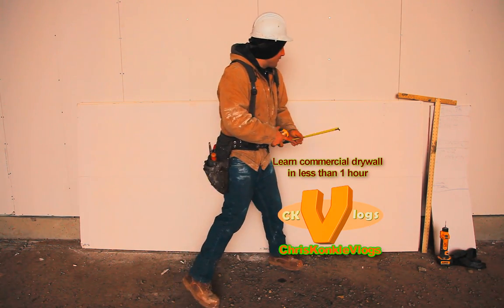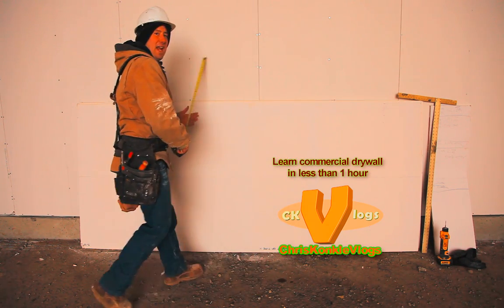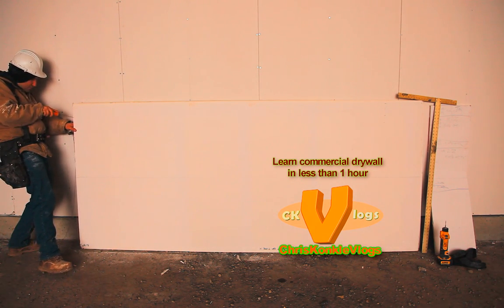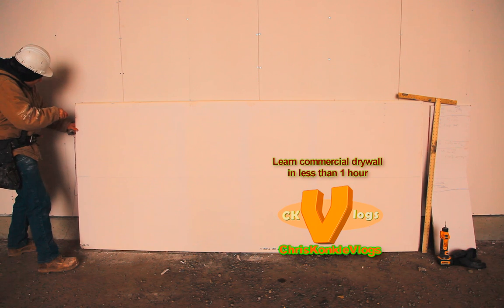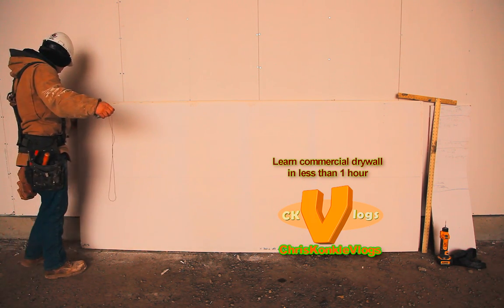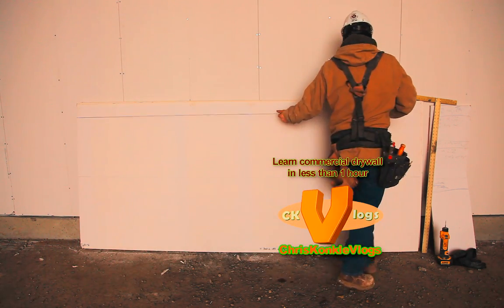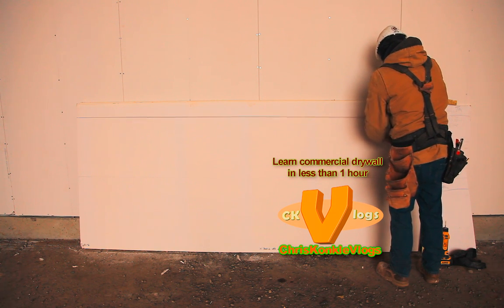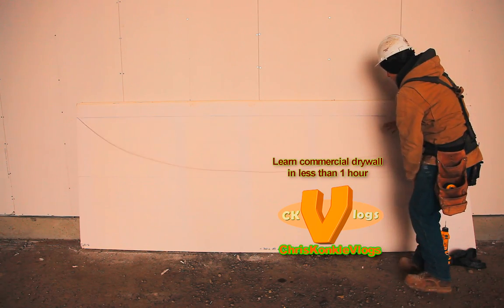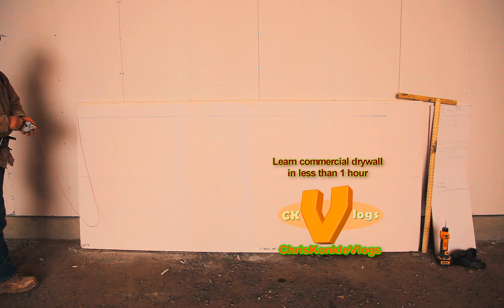Okay, so we have our top cut marked out. I already showed you how to do that. So now there's an angle cut to do here. It's for your chalk line, so you make a little dip in the drywall. That'll hold your chalk line in place. Hold it to the point you're going to cut to. Boom. So there's your line. You're going to go ahead and score it.